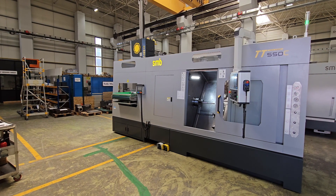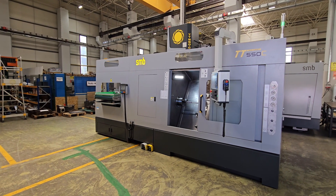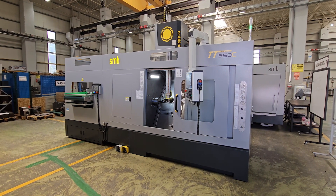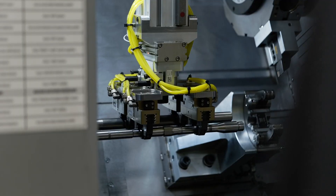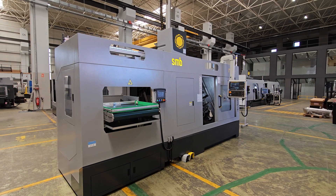To finish off the build of this machine — it's a monoblock, yes. We have a 60-degree monoblock robust machine bed, very powerful slides, with the larger slide on one side, and ball screws throughout. This is a very powerful machine delivering high productivity and high efficiency.